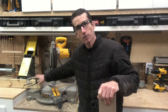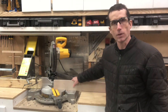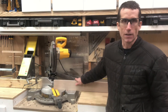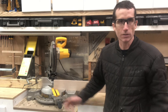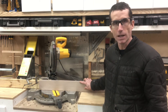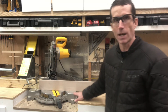I've used C-clamps to clamp this down — I think they're a lot more secure than the squeeze clamp. My first thing is to cut just the end of this board off. I'm going to hold the board nice and tight past the margin of safety. I'm not going to be holding the end that will be my good end — I'm going to be holding the waste end of the board. I'll cut the end of the board, then flip it over, put it against my stop block, make another cut, and repeat until it gets too small to hold, at which point I'll clamp the board so my hands never get past the margin of safety line.